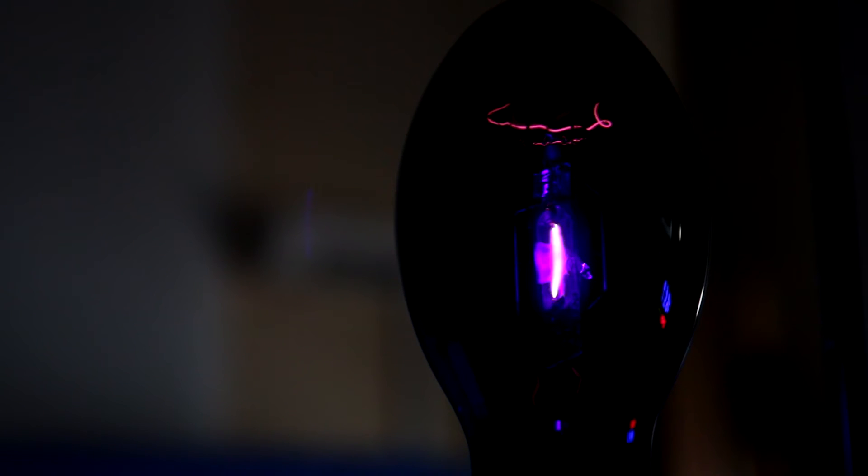I'm not sure how this is going to look on camera because it's very dark in here and there's not much light being transmitted through that woods glass. I'm having to use an extremely high ISO setting, so my apologies if it's a bit noisy. What we can clearly see at the top is the tungsten filament acting as a ballast for the mercury arc discharge below.